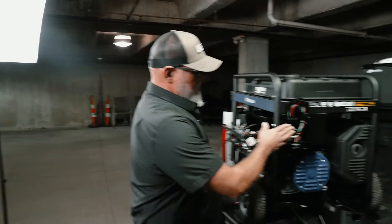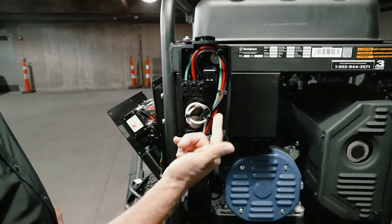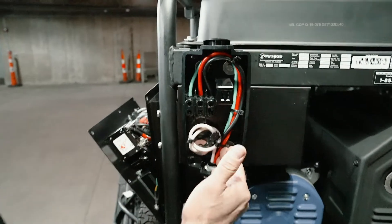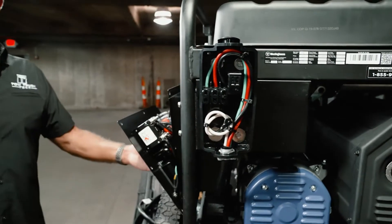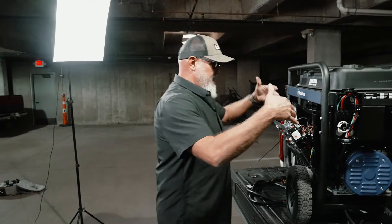Now I'll show you how to hardwire it. Going into the unit, this was a four-wire NEMA 14-50 plug. The neutral does not get used, so we just coiled it up and set it aside. Then wire the green, red, and black as Tesla dictates in their wiring instructions. From there, if you just want to plug it into the 14-50 receptacle you can do that, but we went further to increase performance.